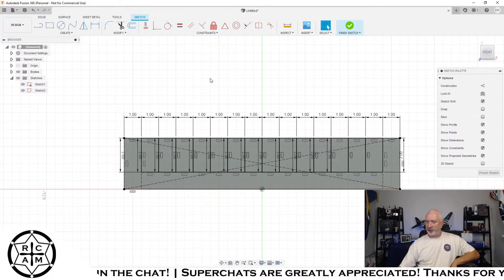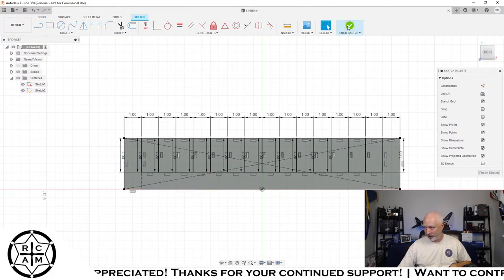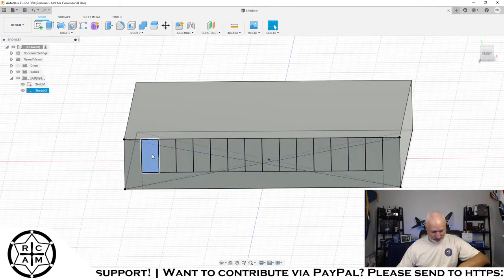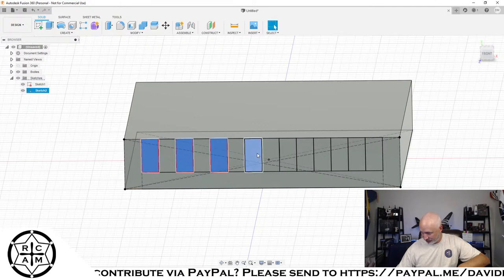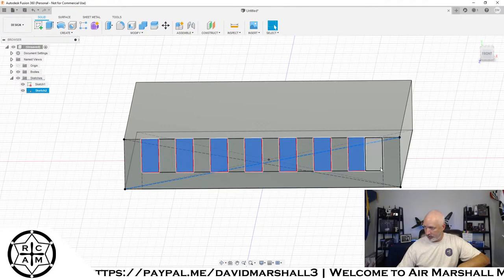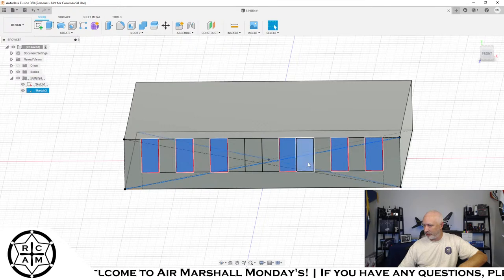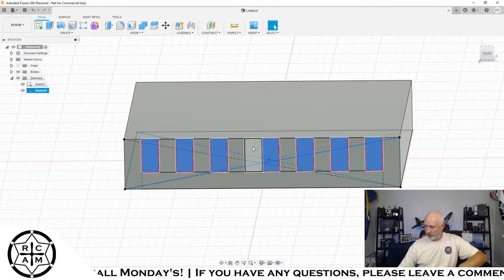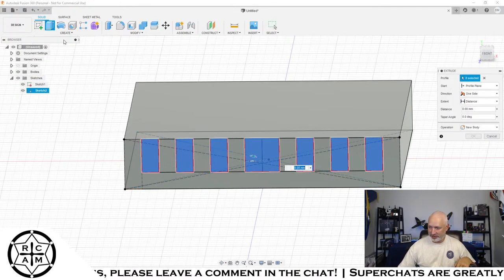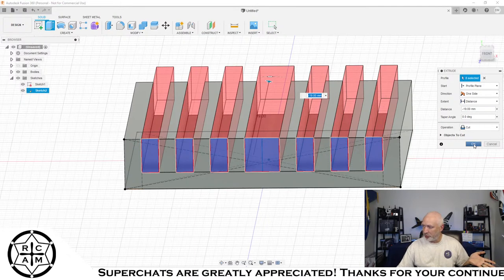Okay, so now we've got this whole thing kind of loaded up with these 2x1 inch or 2mm x 1mm louvers. So we're going to finish the sketch here, and hopefully this will make sense what I'm doing. So every other one of these squares, we're going to highlight. And you know what? We'll skip that one. We'll do this one on the end. And we'll have a double wide vent right in the center. And what we're going to do is we're going to extrude each one of those back this way. And we're going to use that extrude tool to cut those away.